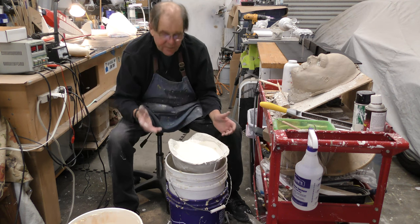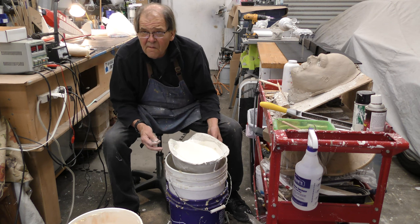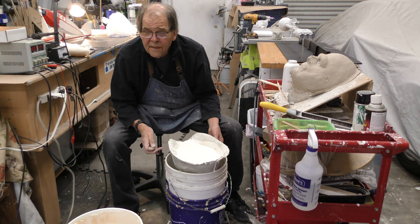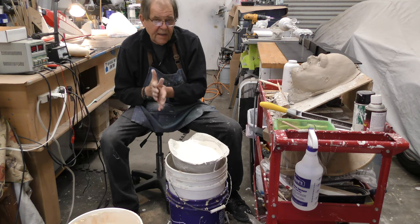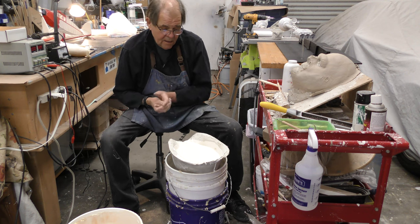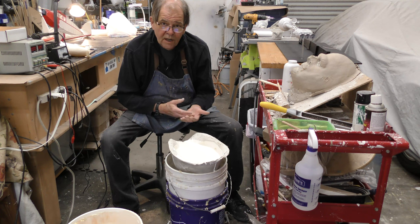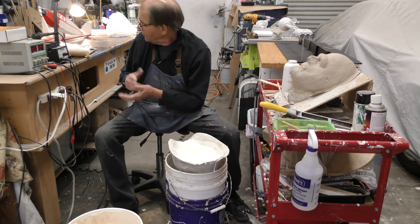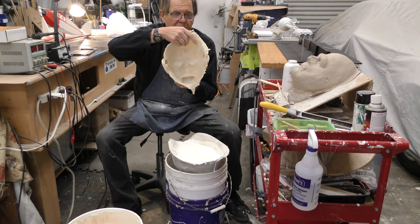And so we're gonna let this set for, let's see, it's 12:15 now. After lunch, I'll pour it out. And it should be fairly thick if I let it sit that long, even though the mold's still green. And after I pour it out, I let it gel overnight. And then it's like the mask you saw pulled out. I mean, the next morning, you have this.